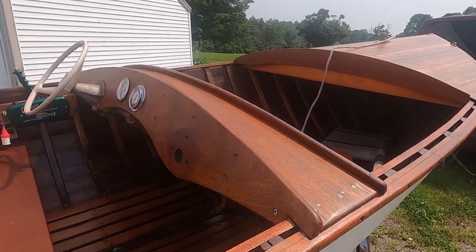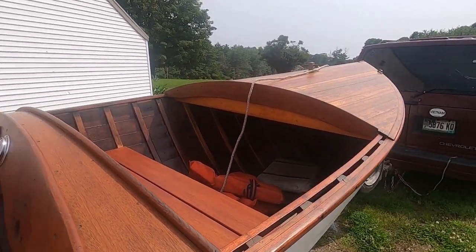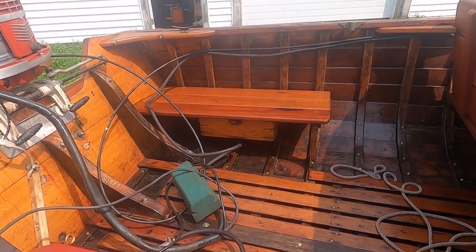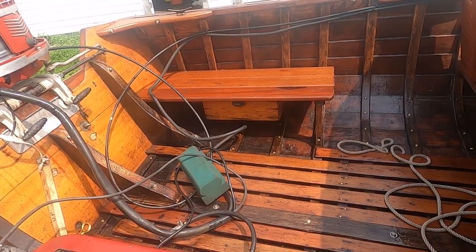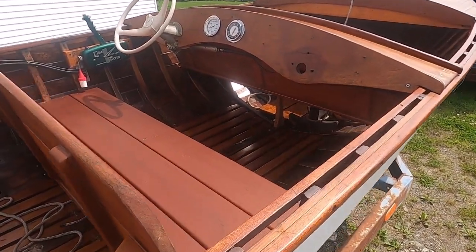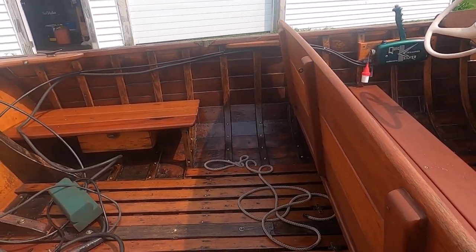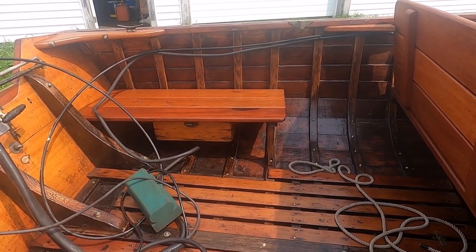The spreading broke a whole lot of screws in the mid-deck and spread the whole thing out. The deck was wide open with red gaps in it, and it had a bad hook in the bottom. So first I put dead batteries in it — about 600 pounds worth — then straps and pipe clamps all the way around the boat, tightened them up, pulled the sides in, and wetted it down. After about two months, that took the hook out of the bottom.